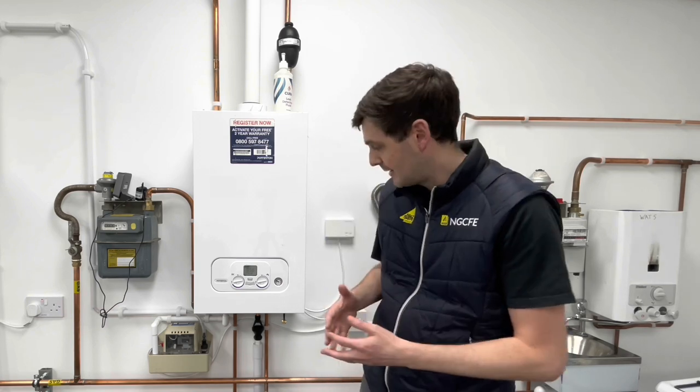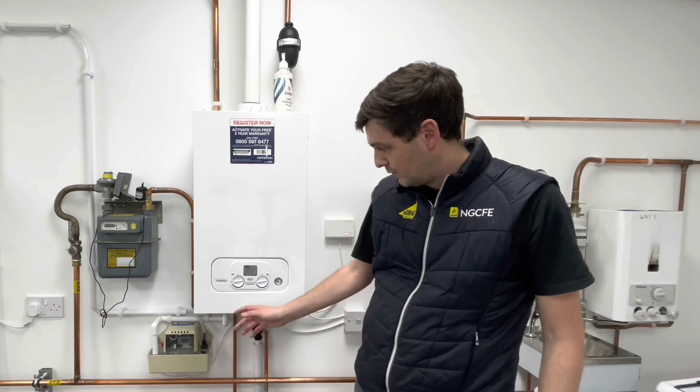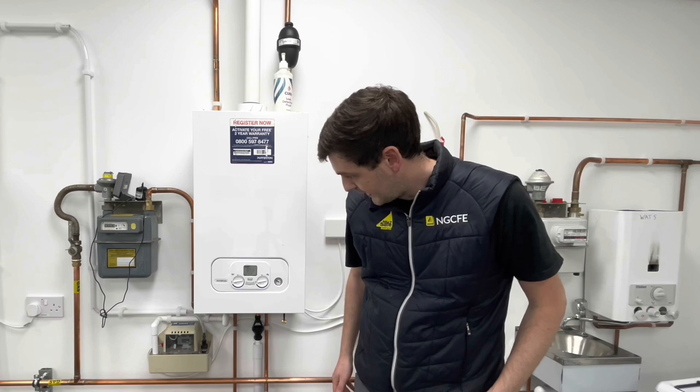The safety device on this boiler, the flame supervision device, is flame rectification. So when we isolate the gas, the board will stop receiving DC current, and it should pretty much straight away shut down the appliance. We may go through a number of attempts to refire as we do with other boilers, but with this boiler, in order to fill the time, I'll talk about other appliances while that's happening. So I'll just pop the boiler on, and hopefully we'll get a demand for heat at the boiler. So whilst we're just waiting for that,